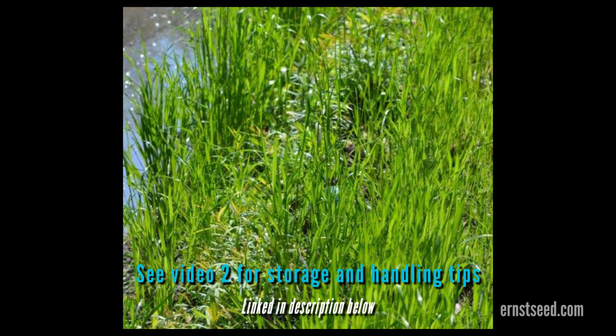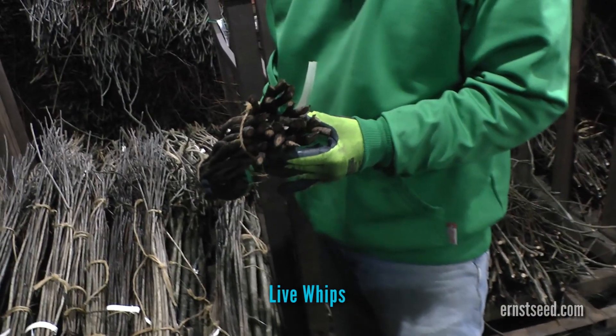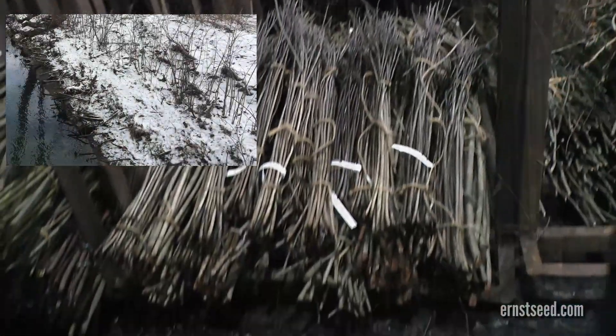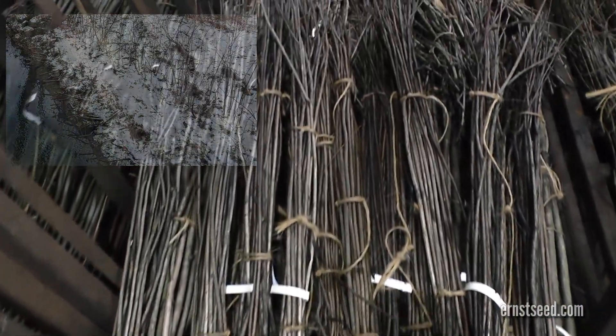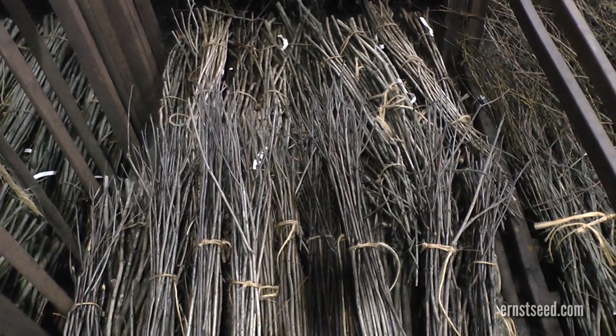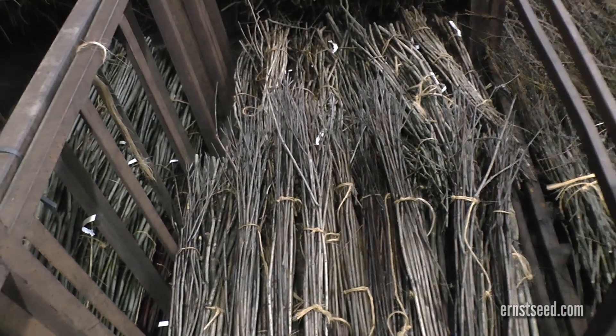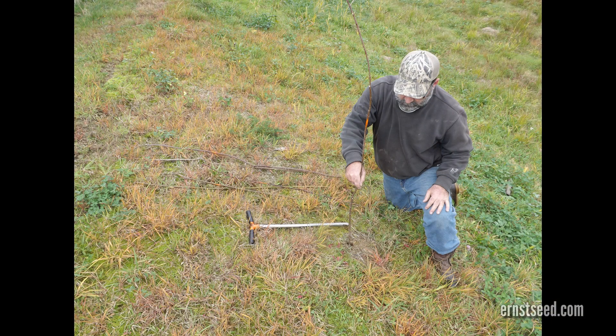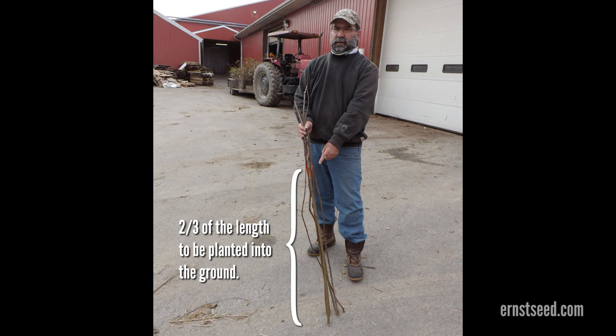Irrigation may be needed after installation if the soil is dry. Whips are slender, live, woody, dormant shrub material. They are well suited for very moist areas of stream edges and commonly used in conjunction with gabion structures, riprap, and geofabric. Live whips vary from three-eighths of an inch to an inch in diameter and are available in four to six foot lengths. Push whips into the ground as far as they will go without breaking; at least two-thirds of the whip should be covered with soil.